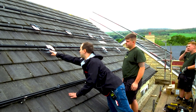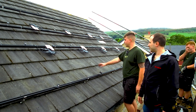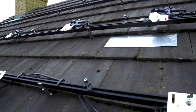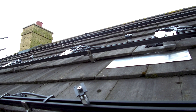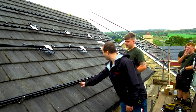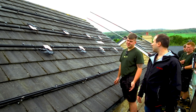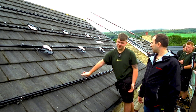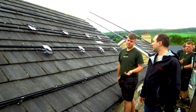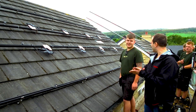When the panels go on to these MC4 connectors they're also pre-made, so you can't get them the wrong way around. We've got clips that clip into the rail and fold over so that nothing's touching the roof — no wind friction on the wires. I've seen roofers leave cables rattling around before. What would happen if you did? Nine times out of ten it wouldn't cause an issue, but it could rub, cause a loose connection, and on a less steep roof water can drive in and over a couple of years that panel would be damaged. Plus the tiles are quite abrasive so you could eventually rub the cable down.